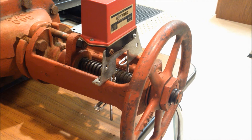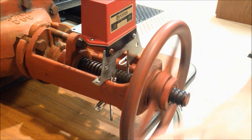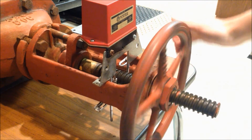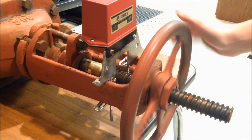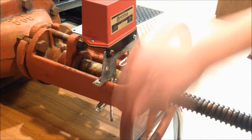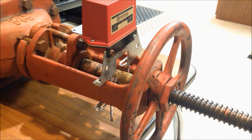When it's time to reopen the valve after the emergency is over and any sprinklers that may have popped during the fire are replaced, the valve is then opened. Whatever method of tamper-proofing was used would then be reinstalled, either the lock or the tamper seal.